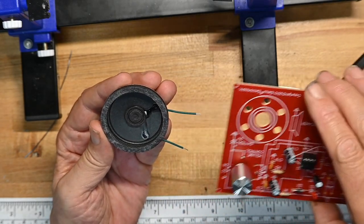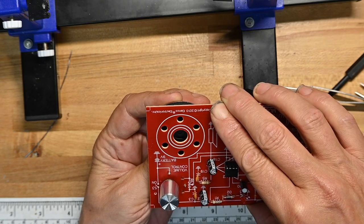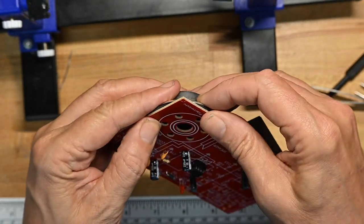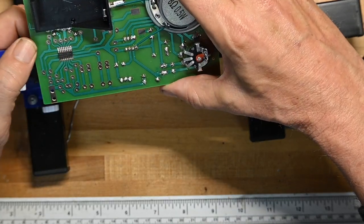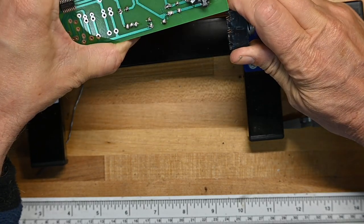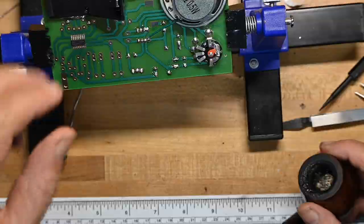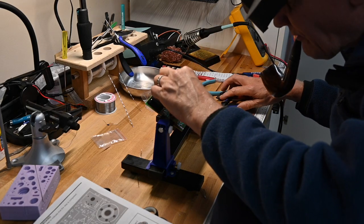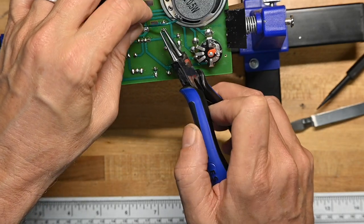Peel that adhesive protector off and go exactly the way we want with the voice coil centered. All dandy. And again, I'll trim that with a razor blade or X-Acto knife when I'm done. Again, if you're coaching a youngster, that may be a frustrating bit, because they'll want to get it just right and they might not. So let them know, if it ends up working in the end and it's your first one, don't worry about it not being quite perfect. Now let's do a little wire bending to get speaker wires on their pads.